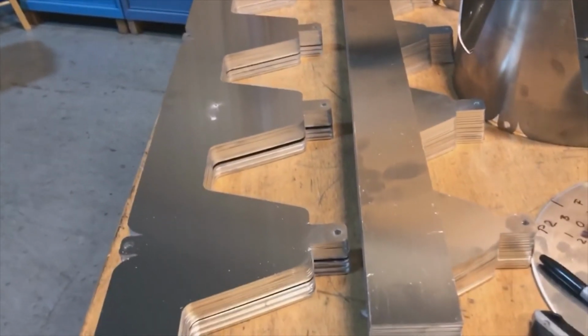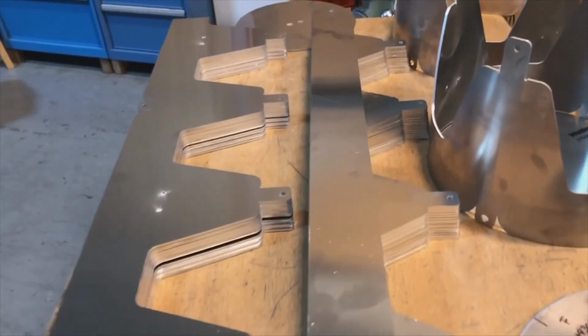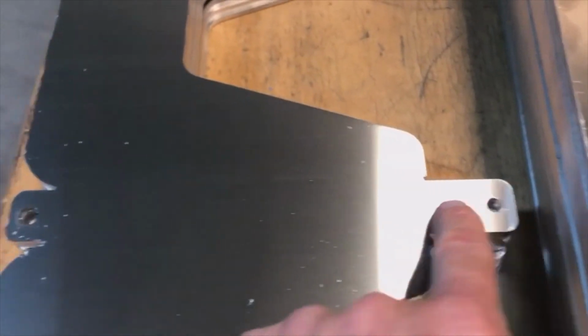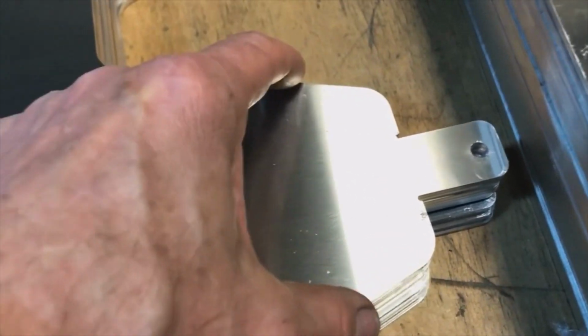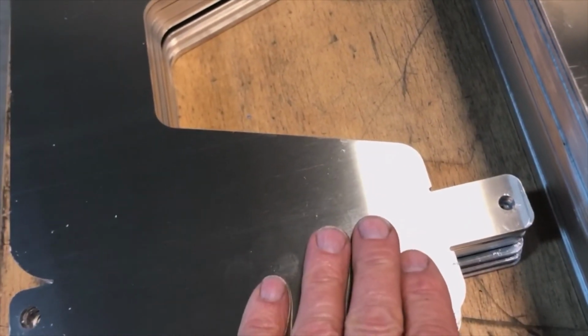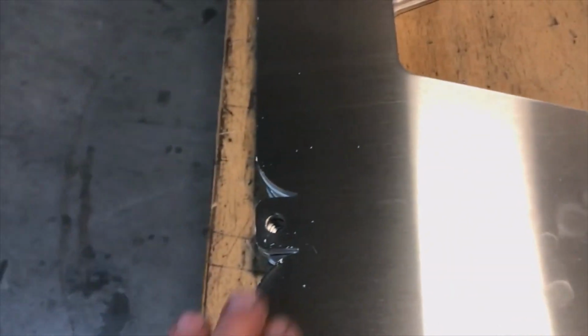Now we are coming to these shapes, which I didn't anticipate at all. And of course, you have changing cross-section. You have a very narrow cross-section here, and you have a very large cross-section here. And in addition, these parts and even these parts are too narrow to really rest on the rolls. So this portion will mainly stay straight. It's going to be very difficult to put an edge rounding in here, especially with those a little bit larger rolls.